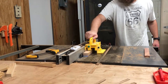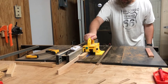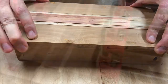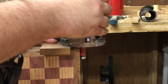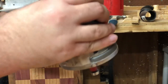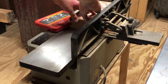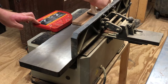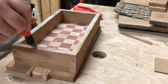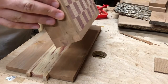I cut some thin strips of the white oak and a broad strip of cedar to go down the center of the base. I glued them up and clamped them with the pipe clamps, but had to do a bit of repair work the next day because of an unstable crack in the cedar. While the repair work dried, I used a flush trim bit to even up the box joints at each corner of the frame. Once that was done, I used the jointer to flatten the faces of the base. I also took this opportunity to flatten the top face of the box and the bottom of the frame so that the base would glue on tightly. I was careful to align the base so that the red and white stripe would be properly centered, and then clamped it down.